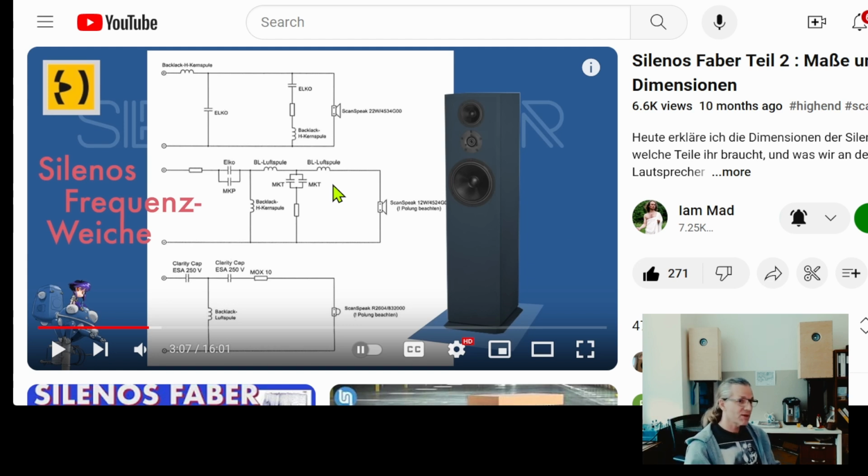So there you go. In this speaker we tried two of the drivers and none of them have a viable active solution to change that. Now let's go for the third one, the tweeter, and let's hope that at least we can make it active. Can we? Nah. There's a capacitor, inductor, capacitor, so this is also a third order filter, and there's a resistor. So there you go. Your choice is maybe just to get this third order crossover, substitute it with an active crossover, but then you need to leave this resistor in place. And it's not just dropping the level, it's also adjusting the impedance of the driver. So that's why in an active solution you cannot just fix it by changing the volume, because that does not fix the impedance mismatch that is being corrected by that resistor.